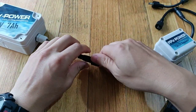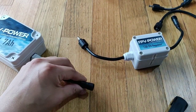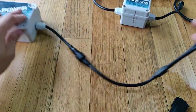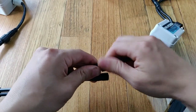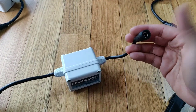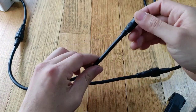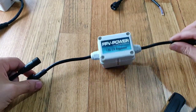If people are using a double pigtail, you need to make note that you do not plug this straight to the battery, because a double pigtail is this — it's a double adapter from the battery giving you two outputs. One output is dedicated to your fish finder, connecting through a fuse or fused pigtail or straight to a male pigtail. The other output here is unregulated — that will be for your LED lights and other 12-volt accessories like spotlights. But the regulated output is always dedicated for the use of a fish finder only.